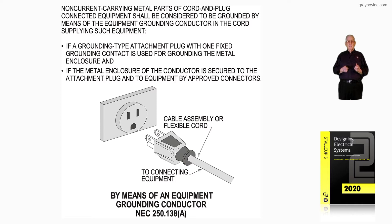In the illustration we have a cable assembly or flexible cord connected and terminated properly to the U-ground shown. The U-ground is the bottom pin, which connects to the U-ground in the receptacle. The equipment ground at that receptacle connects through the U-ground of the attachment cap, routed through the flexible cord and connected to the equipment, providing an effective ground fault path should an ungrounded conductor make contact with the enclosure of the cord and plug connected equipment — through the attachment cap, through the receptacle grounding pin, the U-ground.